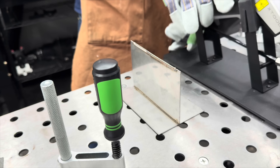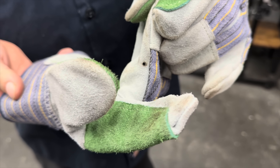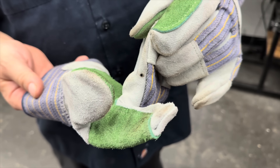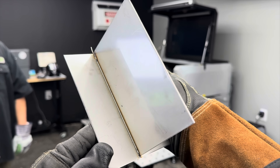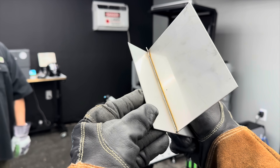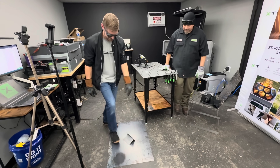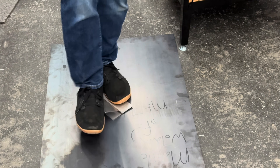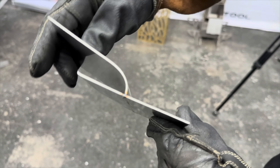I will give a word of caution: when laser welding, always be mindful of where that laser beam is pointing — treat it like it's a loaded weapon. At one point, Zeke was helping to hold two pieces of metal together and the laser beam blasted directly through his leather glove and right into his finger. He played it off like a tough guy, but I can only imagine how bad that must have hurt. The welds almost seemed too pretty to be strong. I figured we would easily be able to break them, especially since it was only welded on one side. But after multiple attempts at throwing it onto the ground and putting all of my weight onto the joint, bending it back and forth multiple times, it was apparent that these pieces of metal were indeed permanently fused.